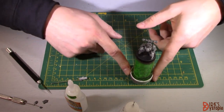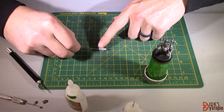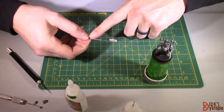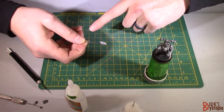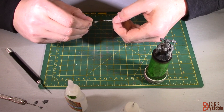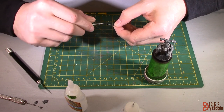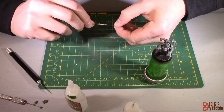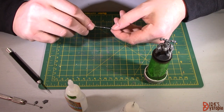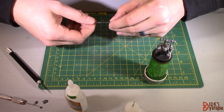Last piece we're going to have to deal with. We're hoping now, with all that time passed, that this is set up pretty nice. The cool thing about this trick with the paperclip, one, this paperclip is super reusable. All I'm going to do is make sure I have a firm grip on the handpiece, and then apply ever so slight pressure, rotating, so that I can spin the thing, and then that glue will just break right loose. It's not really meant to deal with torsion pressure like that. It's mostly back and forth pressure.